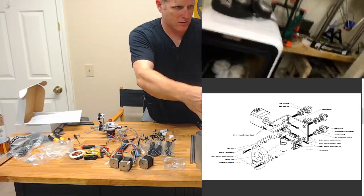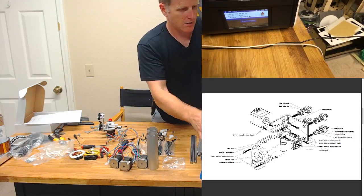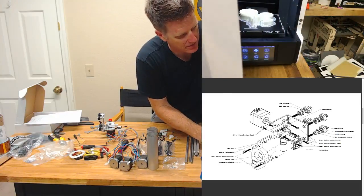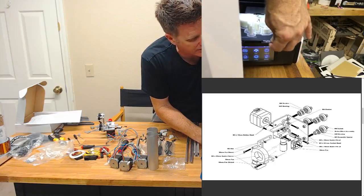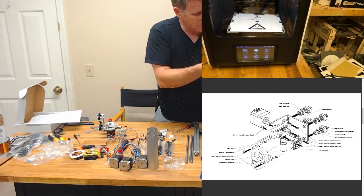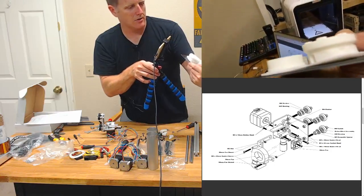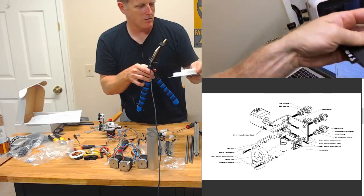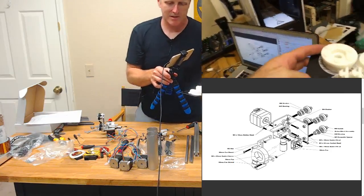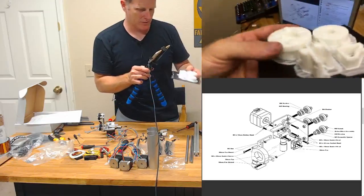Moving mobile camera over to the Up. A little ABS factory. Look at that. Ooh, isn't that awesome? So, interesting thing about the Up, you certainly don't have to print on a raft, but for these guys, I opted to do so. Rats. Okay, looks like I might have a leveling problem here, because I got a nice curl going there. So it looks like we came off the bed. So this guy may not cut it. That might actually still work because it seats inside of the cylinder, but I'll probably reprint that just to be safe. But these other parts look like they turned out okay, huh?